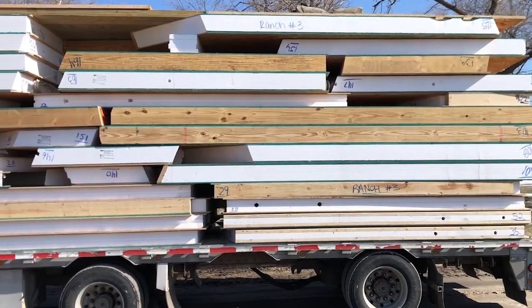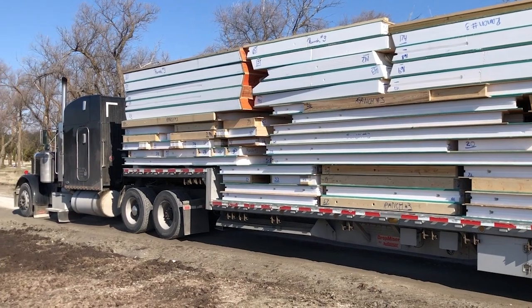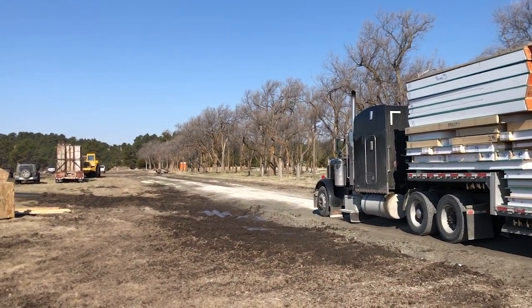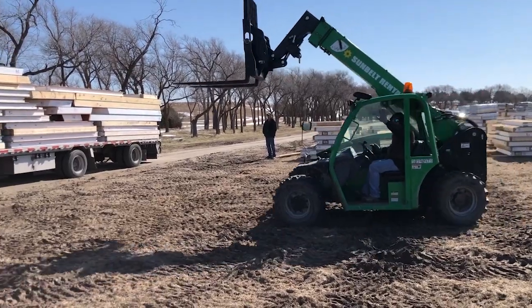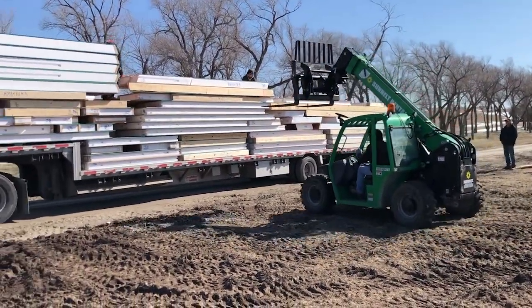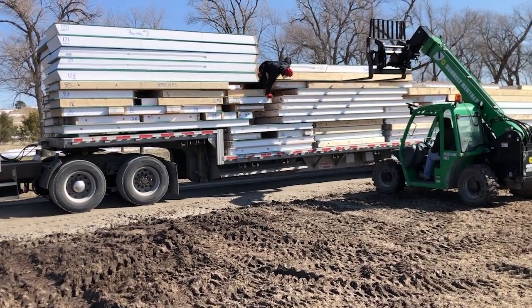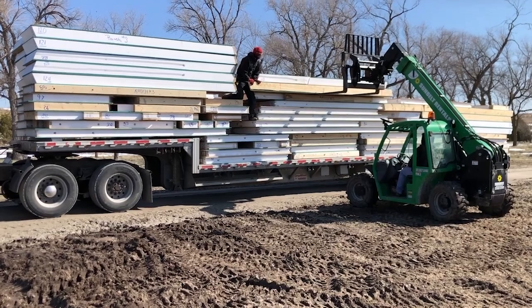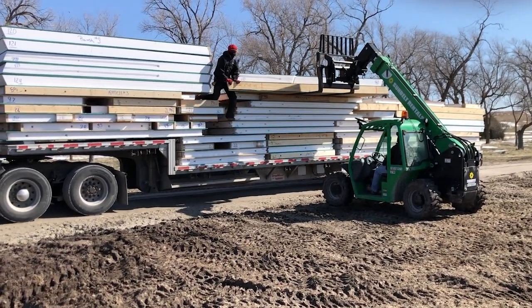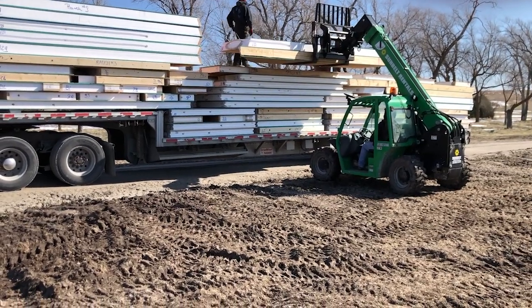Intercept tries to minimize the number of trucks sent to the site. So a lot of times there will not be stickers or spacers between panels, which means you can get more material on the truck, but offloading on site is more challenging because you actually have to climb up on the truck and push the panels off. If you want quick unloading and you're willing to have an extra truck show up, you can ask your sales rep to have the plant put stickers or spacers in between, so you can offload with extension forks on a lull or all-terrain forklift.